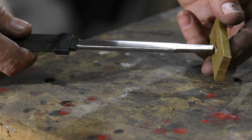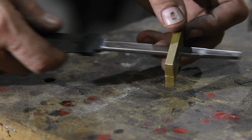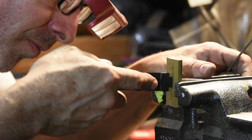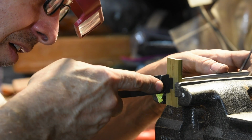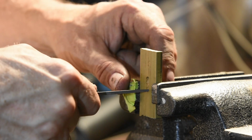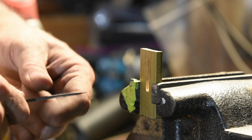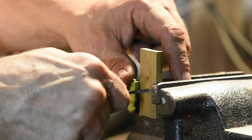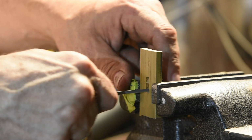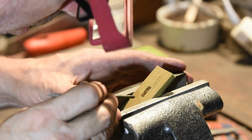You can see here though how it came out. As you can see, the ends are rounded. Those will not fit with the square corners of the tang, so we'll have to file those so that the round edges disappear and we get square corners that will fit all together. I want a press fit here so the guard won't slide on without firm pressure, so as to make sure that there are no gaps between guard and steel. You don't want to overshoot, so a lot of try-fitting is required.